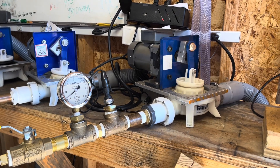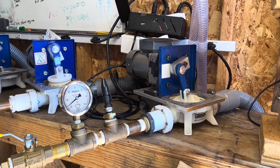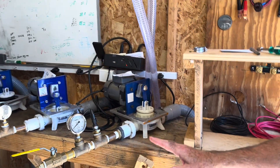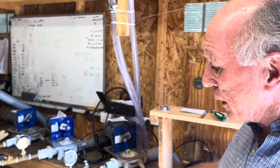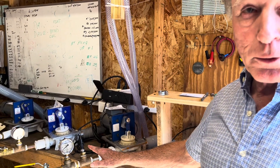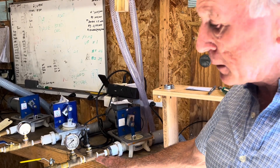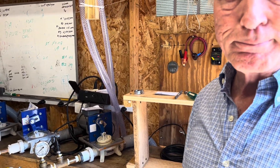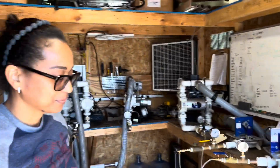The most important thing is that the sugar maker needs to detect and manage leaks, keeping them to a minimum. These are low CFM pumps, so if you have leaks they won't be able to keep up with the vacuum. But if you manage your lines and keep leaks out, the pump is able to achieve a very high vacuum for you. Thanks, Doug. Thanks, Ingrid.